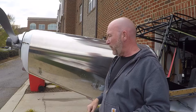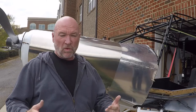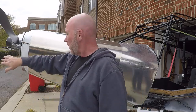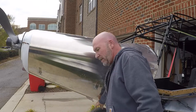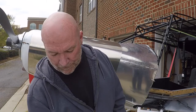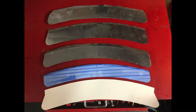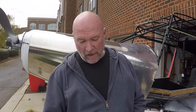It was slow, time-consuming like everything else. For example, there's a lip at the bottom entrance of the tunnel which creates a low pressure area to pull air out of the cowling. Air goes through the inlets and exits through the bottom, and that little lip creates a vacuum pulling air out. I started with aluminum and had four iterations before I finally completed it, also using some poster board templates.